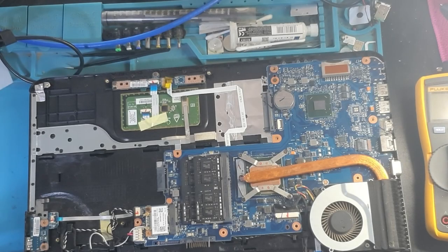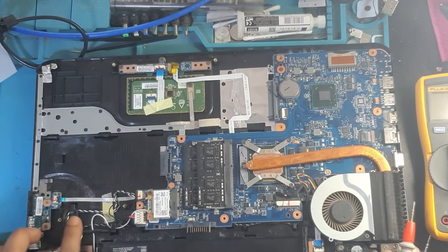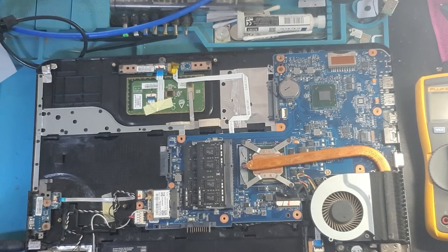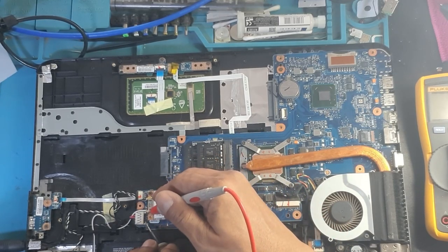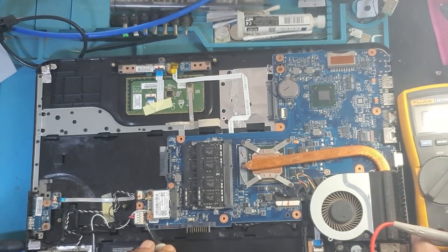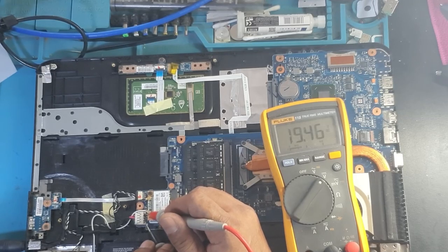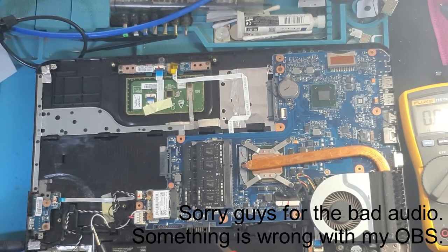The first thing I wanted to check is the 19 volt on the charger. There is the charging port, and the cable is coming here. It's connecting to the motherboard through this connector. So let's have a look if that connector has 19 volt. Okay, you guys can see there is the meter, 19.46. Okay, now I want to check the first and second MOSFET if that 19 volt is present there,